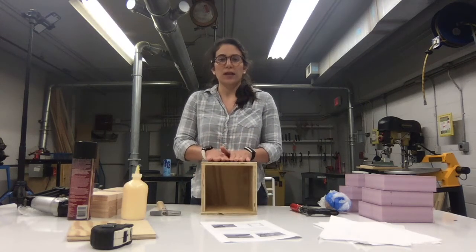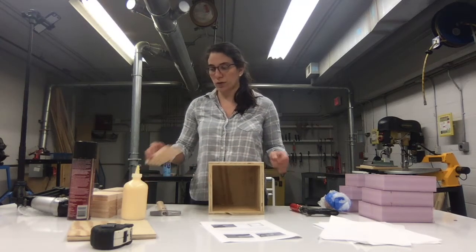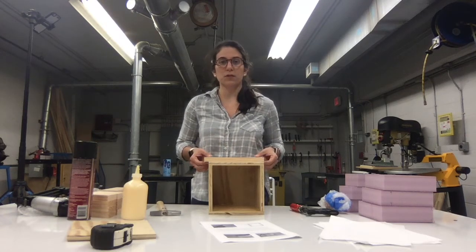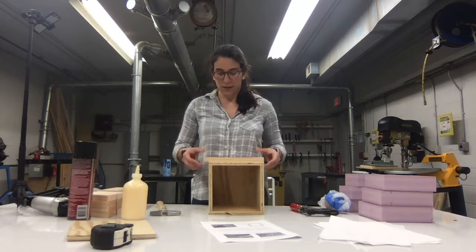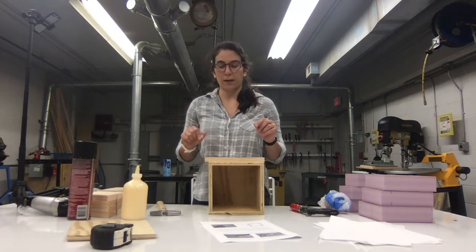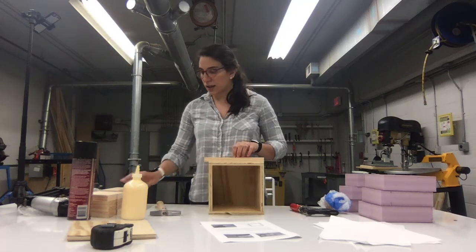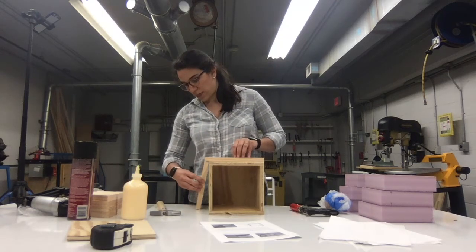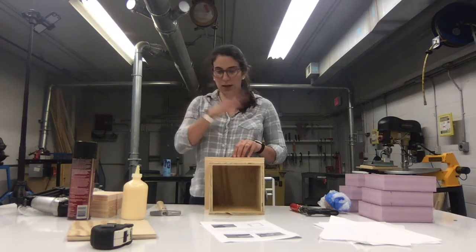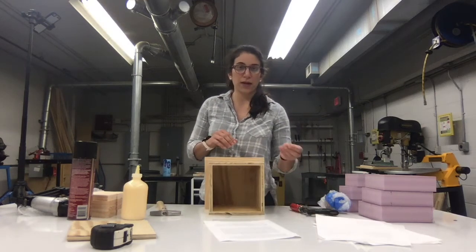So for example, this is our longest piece. We're gonna cut the battens in order so that we have another long piece that comes on top and creates that C form that I was saying, okay? So we're gonna have two pieces that are long, and then we're gonna have the insides that are short, okay? By saying this, we are creating a double butt joint.